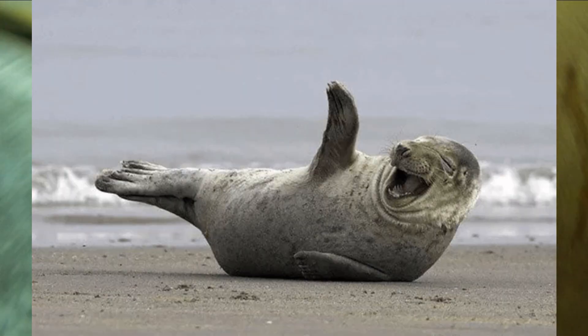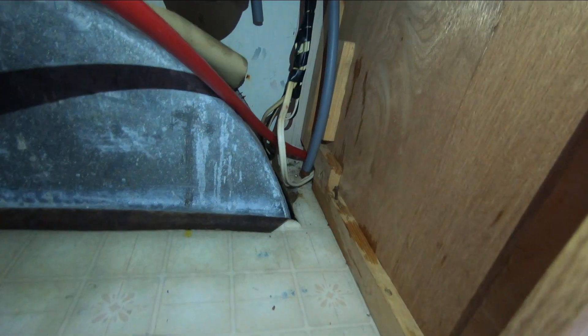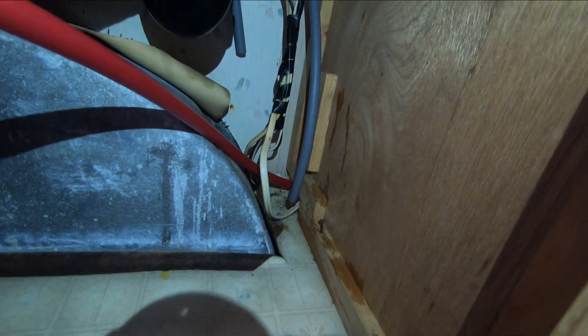That wiring — see how they do that on these RVs? That's not me, that's how they factory-wired the RV. But our point today is not the wiring; it's that pipe back there. You see that pipe I've cut off? We're going to join the PEX to the poly B in there, and I've got enough room to run my crimper above the wheel well.